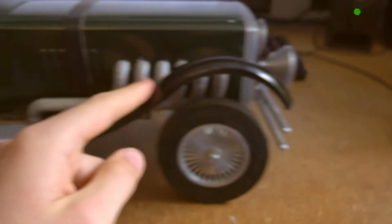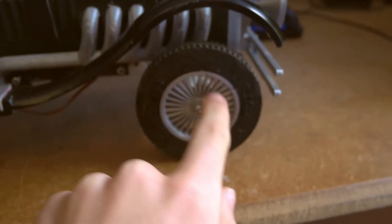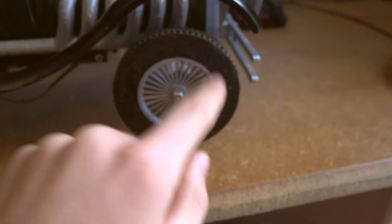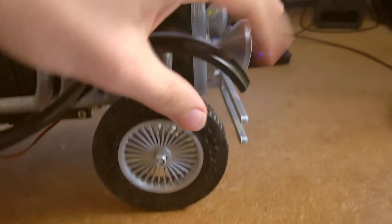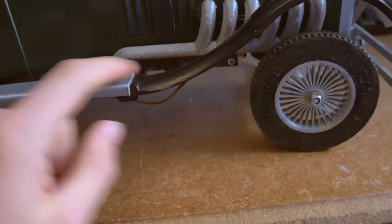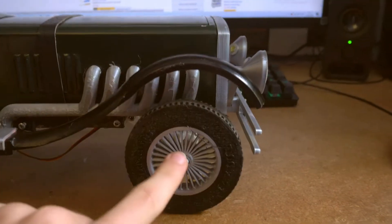The wings are actually a swept extrude. I basically used SOLIDWORKS and made an extension for each wheel — like an extra circle at each wheel position — then copied that down to a new sketch, drew the front section, swept extruded it, then made a square section where the running board is and filleted out the edges. They're actually slightly thinner there — they sort of sweep, giving a very nice front. I think it's 45 degrees or something from the centre of the wheel.